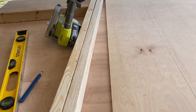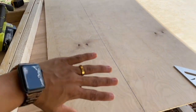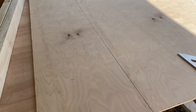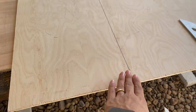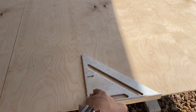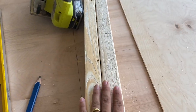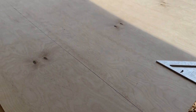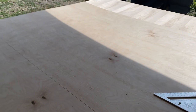What we've done is taken our plywood and measured out a length of 53 inches, cutting the board across. Next we're measuring out the pieces that will cover the column sides: the first one is 11 inches, then another 11-inch piece, and then two pieces at 9 inches — and hopefully those will wrap around our two-by-threes at 53 inches. We'll make the rest of these measurements, cut the boards, and I'll show you the results.